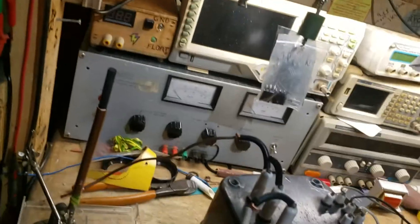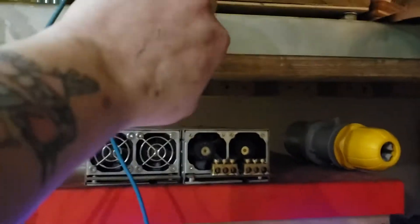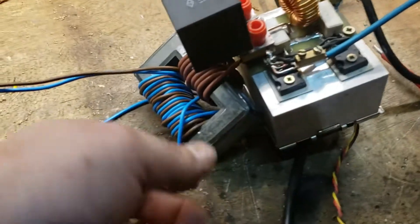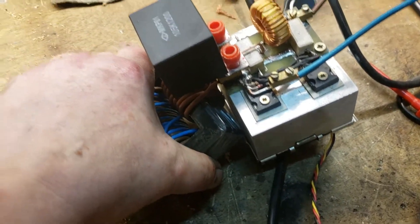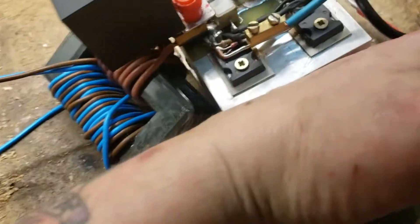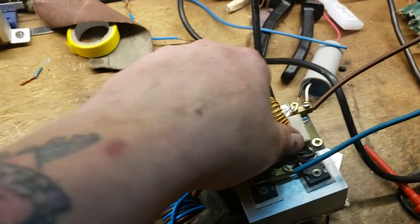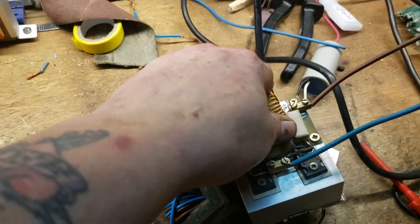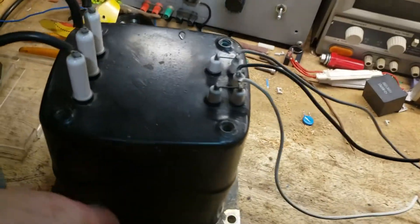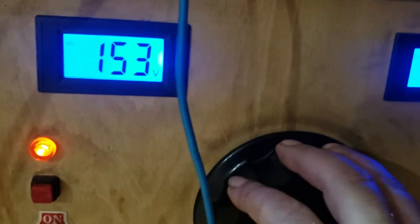Right, we'll just pause again at that guys and have another feel around to make sure we're not overheating any of this stuff. I'm sure that inductor won't take much more of this. Yeah, we're starting to warm a bit now, but that was a lot of current. Transformer is still cold, the capacitor is cold. It seems slightly warm but I can put the back of my hand on it so it's not that warm. It'll be the inductor we'll have to be careful of. Yeah it's hot but still touchable. This transformer is stone cold - I think I'll take that all day. It's obviously oil-cooled as well because there's oil in there to insulate it. Quite nice. I think we'll just push it a little bit higher and then crack on with building a proper driver for this - I think we'll use the ZVS because this is quite impressive.